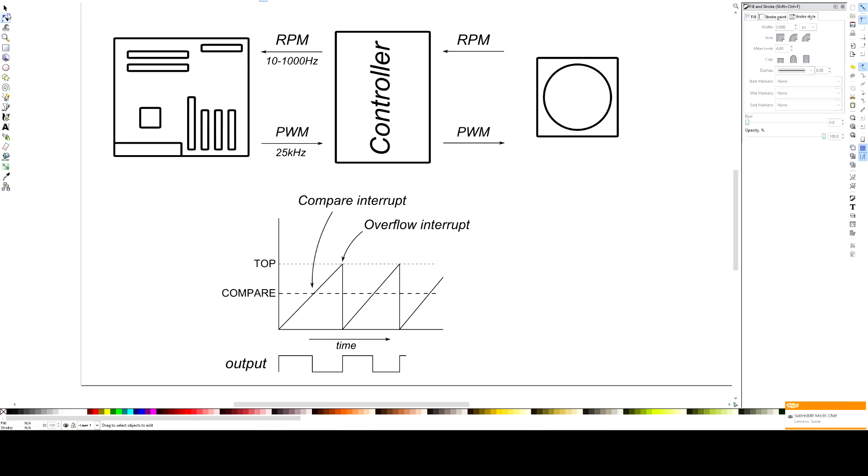At this point, it should be quite obvious where my design decision to use the ATtiny24A kind of breaks down. We have an RPM signal to make and a PWM signal to make, and we have two timers — so we can use one timer to generate one and the other timer to generate the other. But then we also want to be able to measure the PWM signal coming from the motherboard and the RPM signal coming from the fan, which means we don't have any timing resources left. The best way to do this is just to have four timers — to choose a microcontroller that has four built-in timers. I could have done that, and actually it wouldn't have been that much more expensive; that was probably just the better solution.